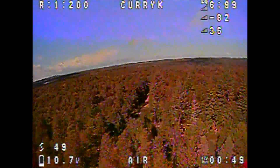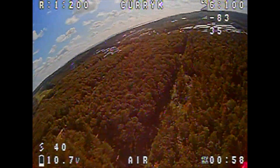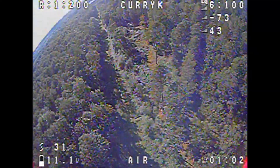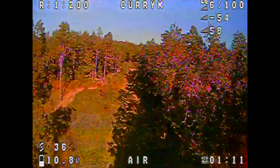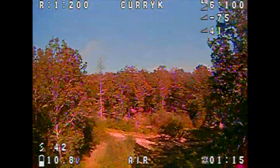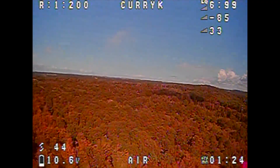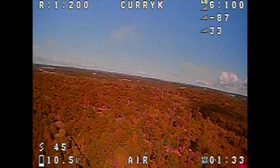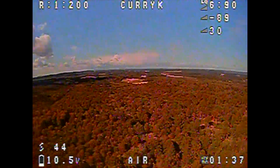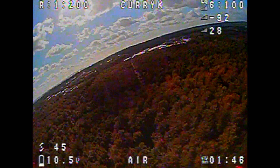The second OSD element is the dBm RSSI signal strength. People say you want minus-whatever for a good signal but it doesn't really work for me intuitively, so I'll probably remove that. Finally there's the actual RSSI indicator below which is completely useless for ELRS — it's a really odd little value. For Crossfire, ELRS, or anything like that, ignore everything except the LQ because LQ tells you everything. Flying out now and correcting against the wind, the LQ is occasionally dropping three or four points but mostly sitting at 100 — and don't forget this is a tiny receiver completely buried inside this little model.